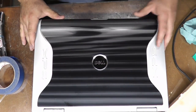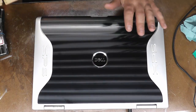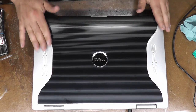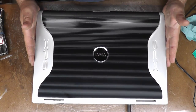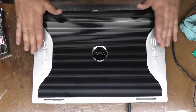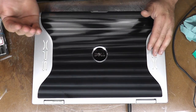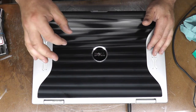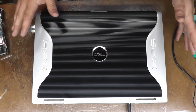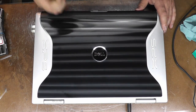Now I know you're asking why I put my video card in the oven. The reason is simple — it was broken. It came out of this computer here, which is pretty old, maybe five to eight years old. It's an older Dell XPS which at the time was one of the fastest laptops on the market. What happens with these gaming laptops is they overheat a lot, and when they overheat you get micro fractures in the solder joints of the chips to the PCB. You'll get either graphical glitches or your computer will just completely quit working altogether. By putting it in the oven, it heats up those solder joints and remelts and seals them.